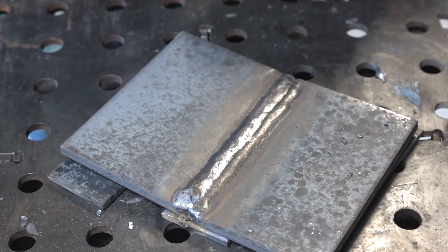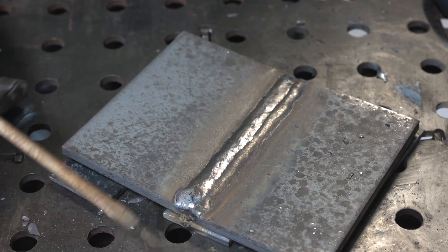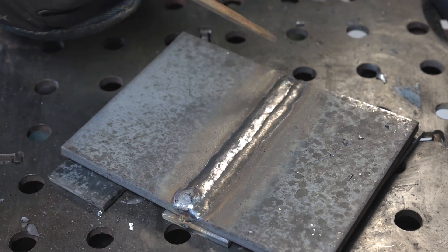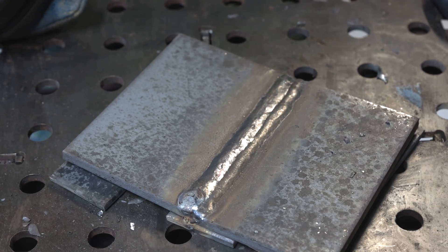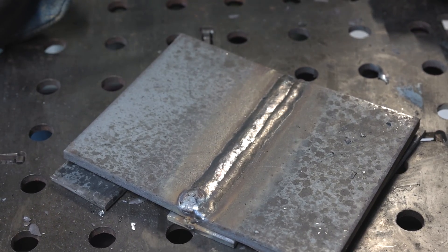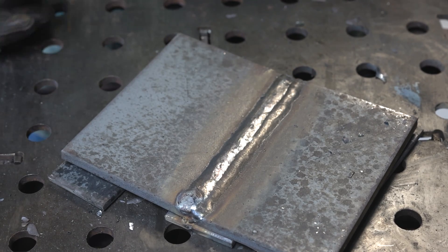I finished out the plate, and this is the common problem if you don't use your runoff tabs — I have a little bit of concaveness there. If I had a runoff tab, it would have been fine. That's why we have runoff tabs: so we don't have highs and low spots in our weld zone. Technically, the D1.1 first inch and last inch is all scrap, so technically I'm within spec, but that is still up to the CWI's discretion. It took me roughly a root, hot pass, two fills, and two caps to get this plate above flush but not over an eighth. That's dual shield flux core in my home shop doing a D1.1 procedure — AWS structural steel procedure on a Cyclone 312 at home. I can do code work at home with this machine and that wire.